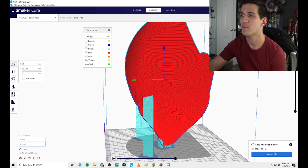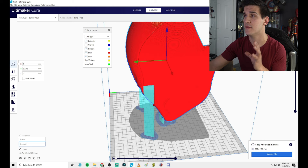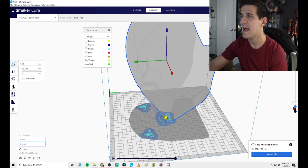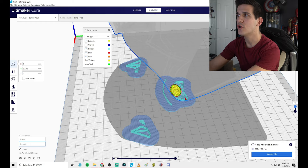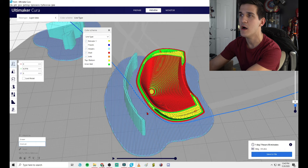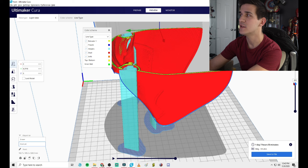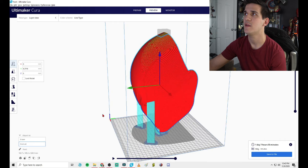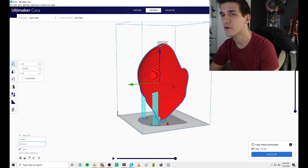Don't worry about the time — you're going to adjust this however you deem fit depending on the quality and infill. I think this is roughly what mine took on the CR-10 Max, and it was about a day of a print. You can actually see it and track it as it builds up. I always like to watch the first couple layers in the program as it goes up and prints, because if I notice it's not getting a lot of good support as it's moving, I'm going to go and try to rearrange it. You can see where all these zigzags and crisscrosses are — that is actual direct contact support for the model, so it's getting a lot of good support early on. You can track this by using your arrow keys and moving the slider bar up and down, and you can actually watch and follow the print. The eyes actually are being supported. This is pretty much exactly how I printed it, and I would send that print. It's only going to use barely 400 grams of filament. This fits on a CR-10S, an Ender 5 Plus, an Artillery Sidewinder X1 — a multitude of printers.